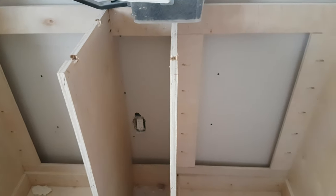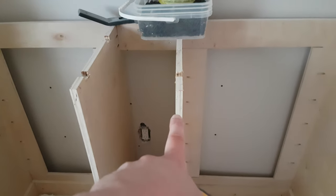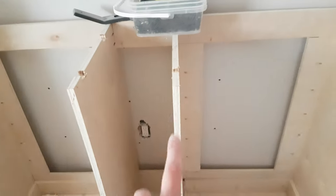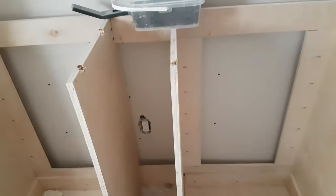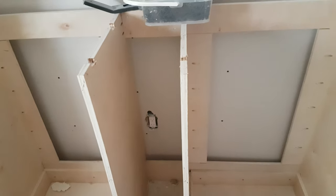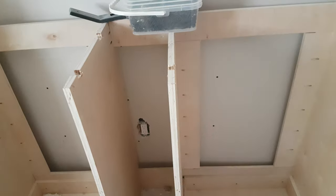What I may end up doing is — this is three-quarter inch — I might get three-eighths inch and glue the two sheets together. That way, because I'm gluing them together, I can make sure that they're flat. Even if they're warped to begin with, they'll be flat by the time the glue dries.